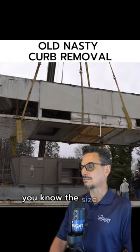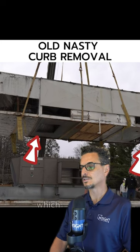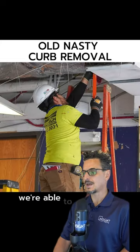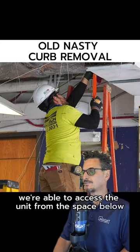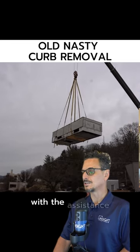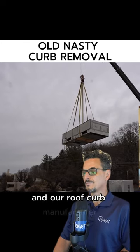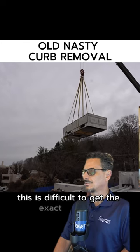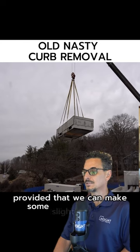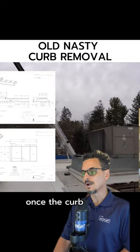We need to determine the size and location of the supply and return air openings, which can be a little bit of a challenge — and it was here too. We were able to access the unit from the space below and find out where the duct connected to the unit and take some measurements there with the assistance of our contractor and a roof curb manufacturer. This is difficult to get the exact locations, but we're shooting for close enough, provided that we can make some slight duct work and curb modifications once the curb arrives.